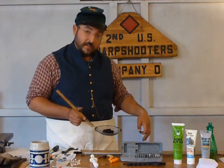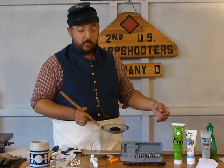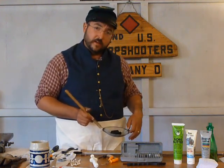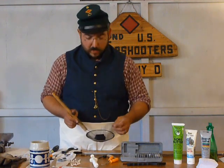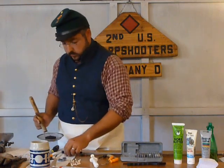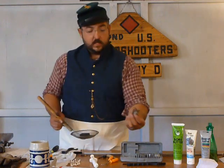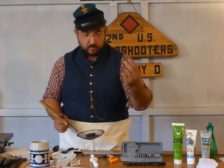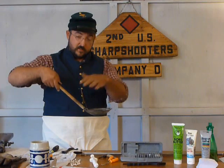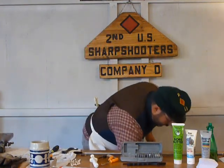Just below the table here, I have a one-gallon metal bucket full of boiling water. I heat it up on the stove — at a reenactment, we heat it over a fire. At home, I add a little bit of dish soap to help break down the black powder. In goes the block, fully disassembled. The cone, all the parts, everything I want seasoned. This is stainless steel — you can hit this up with a regular gun cleaner, but it's all going in together and it won't harm it. Since it's in the spider, you don't have to reach into the boiling water with your bare hands.